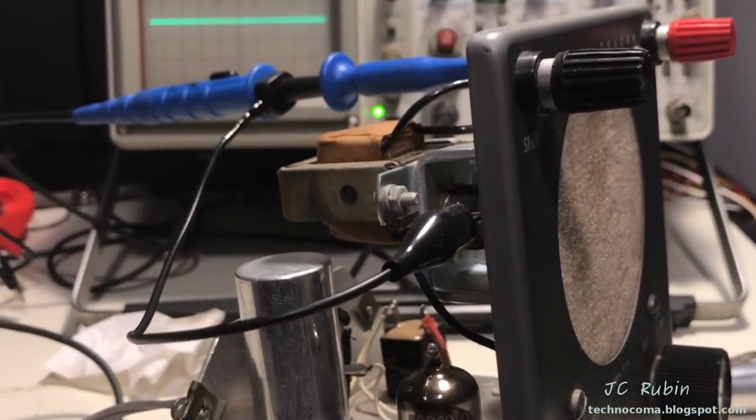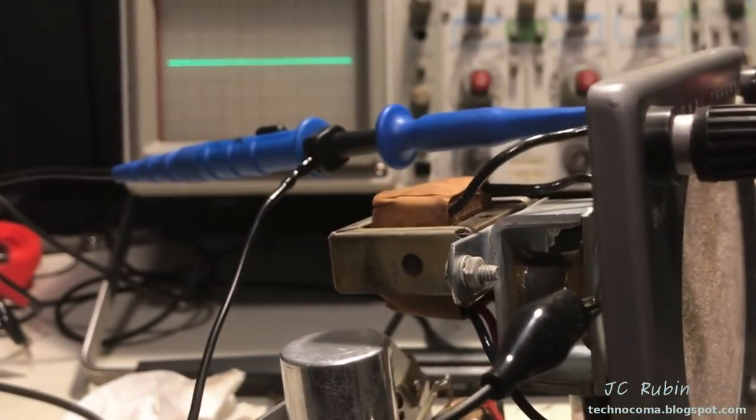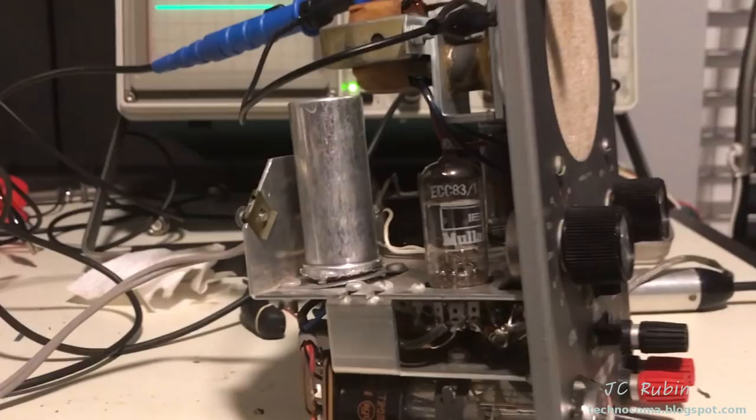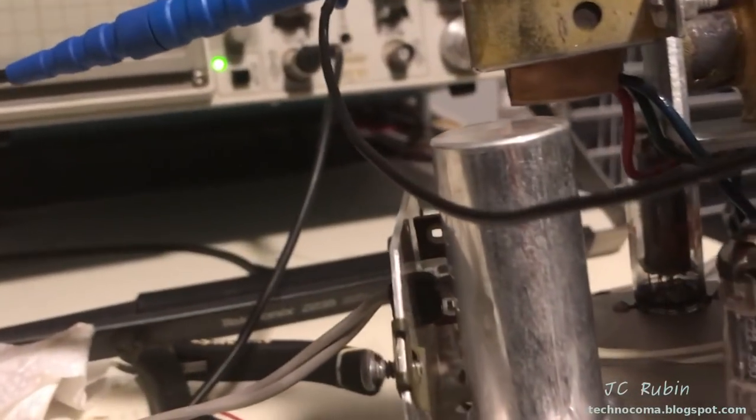same process. Like I said, there's a 5-video series. People can watch, link again above. So I'm going to bring this up on the Variac. I'm going to monitor the speaker output here, and I'm going to note any discrepancies going along with that. I'll be shutting off the overhead light for this event. This is a standard Variac turn-up.